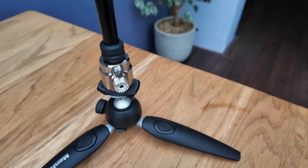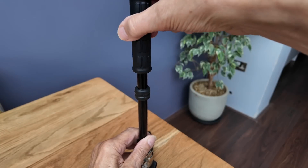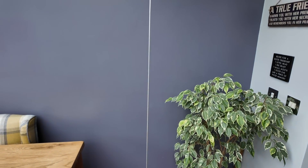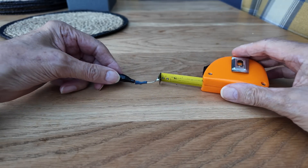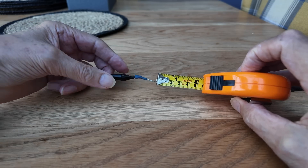The antenna I'm using is the Yaesu ATAS25. Let me show you how it goes together in case you missed my earlier video. The ATAS25 is a base-loaded antenna designed to fit onto a camera tripod. You adjust frequency by either sliding the coil up and down or rotating it for fine tuning. The whip section comprises three aluminium sections which screw together. When finally assembled, the antenna is just over two meters tall. Now we need a method of connecting the tape measure to the base of the antenna, and I used a crocodile clip.